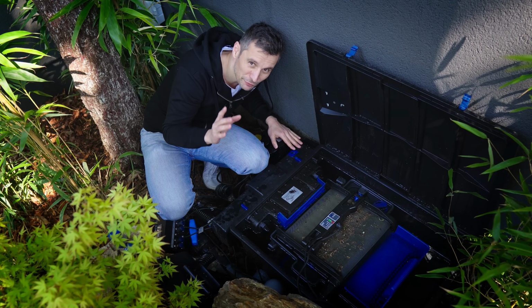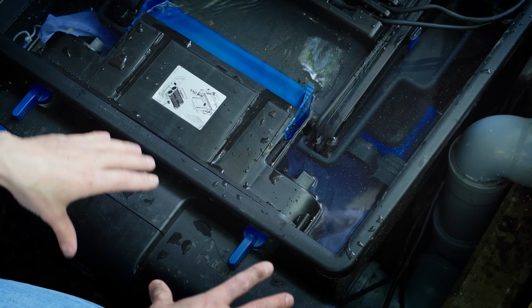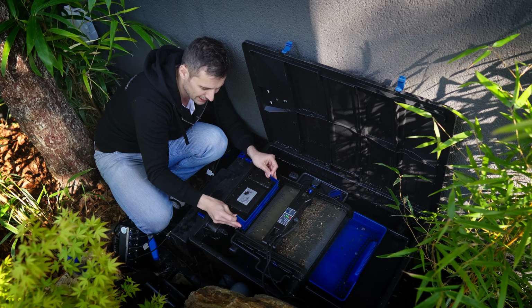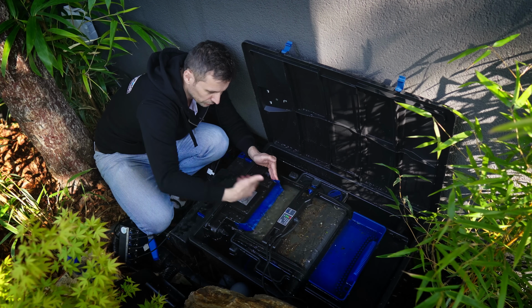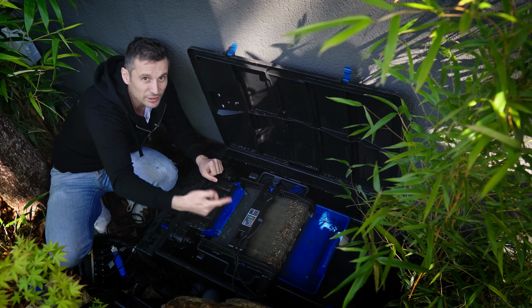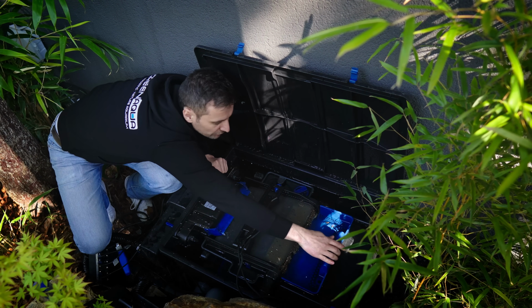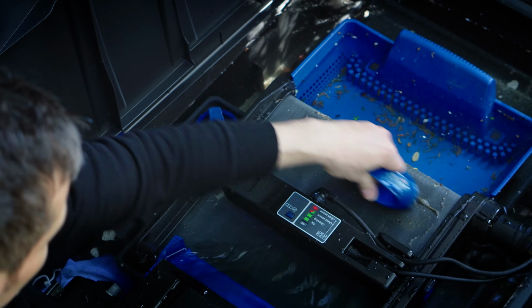I'm here right next to the filter canister, courtesy of OASE. As the first step, the water will come into this UV filter. At the top of this chamber here, when you release it, it will let the water through the screen itself. And this screen is taking care of all the big debris. See what's happening? So it's increasing. It takes care of everything and it will bring all the debris inside there. If you want to clean it, you can use a brush.